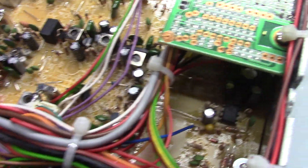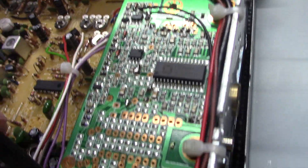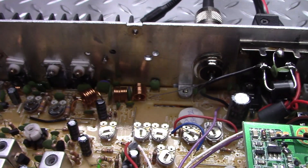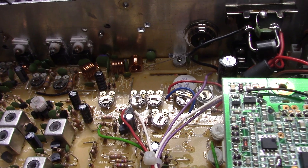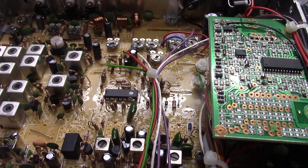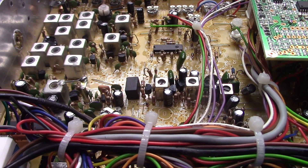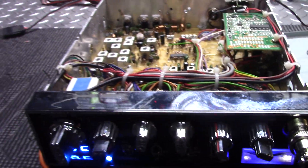Let me get my pointer. You can see down there — TR32 is gone. So this radio is clipped. Not really seeing anything else done to it. The limiters back here look good. So I'm thinking that TR32 is going to be the only thing I have to replace, and then this thing should be ready to go. Hopefully that'll do it, then I can get on with the full tune up and alignment.